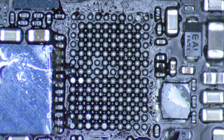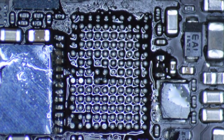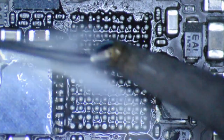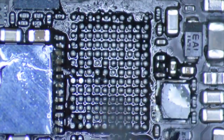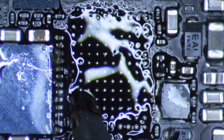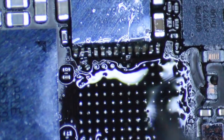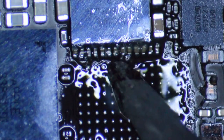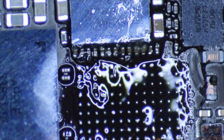For the most part, cleaning off around the edges should be sufficient in this case. We should be able to do a proper fix and run the M1 jumper so we don't have to worry about future touch disease issues on this phone. Let's go ahead and get these pads tinned since we've already added fresh flux. I try not to actually touch the pad with the iron — I'm using a big ball of solder on the end to just touch these enough so they're evened out, remove the oxidation, and hopefully end up level so the new chip sits flat. On this one we'll need to take an extra step before installing the new touch IC: run the jumper.